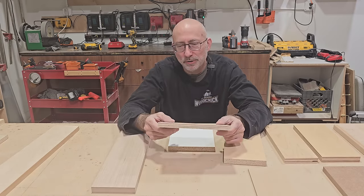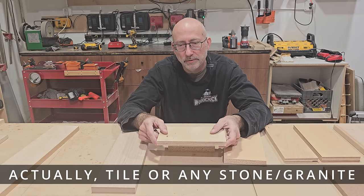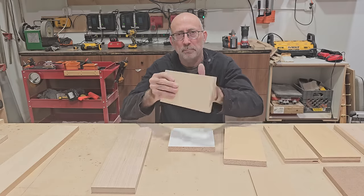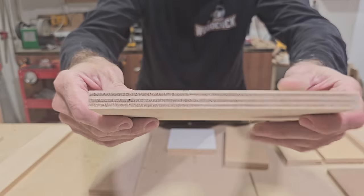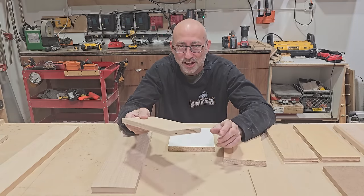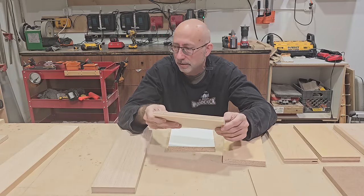This here is what's called an import plywood. I use this for the rough top of base cabinets before they tile, because it's just a cheaper plywood and you don't need anything fancy underneath there. But honestly, this stuff feels like balsa wood. Screwing into this is terrible — I would not build boxes out of this. Even though it looks fine on the surface, it's so lightweight that when you drill into it, there's barely any holding power. Also, you barely touch it and you get a splinter.